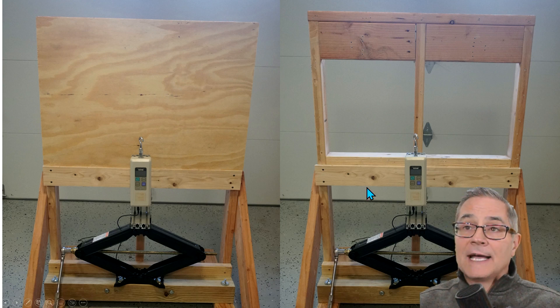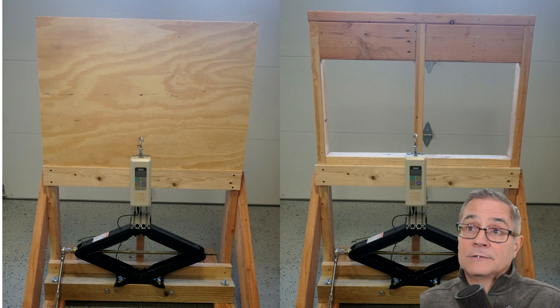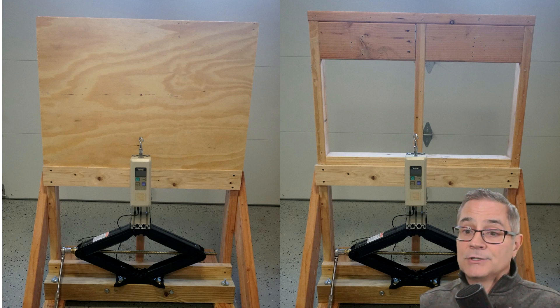This picture here is actually my test system for when I'm testing grab bars. This is a two-by-four frame structure and this is actual blocking here — a two-by-six that I'm using. I screwed it through the side, took pocket holes with my Kreg jig, and reinforced it. I put the first one in, screwed on both sides, then put the second one in and used Kreg jig pocket holes. The intention of blocking is to hold extreme high weight loads, whether it's cabinets, grab bars, toilet paper holders, microwave ovens — whatever it is.